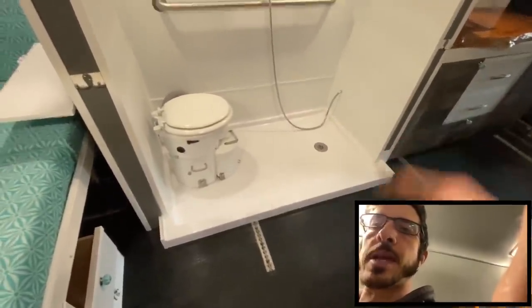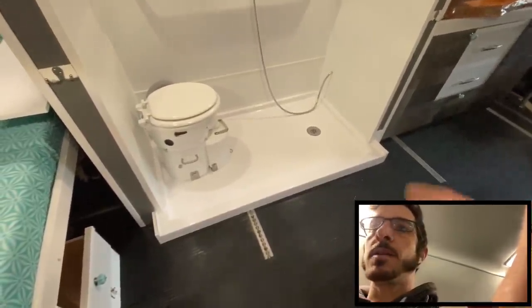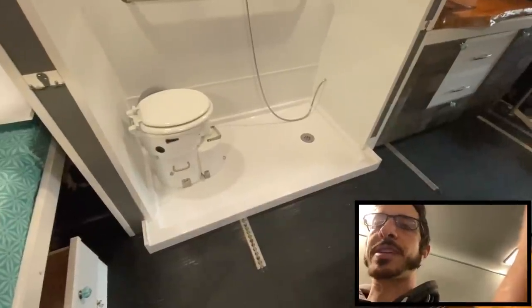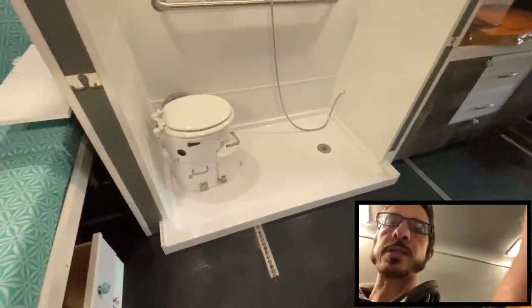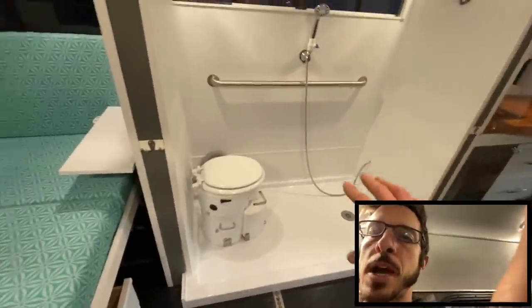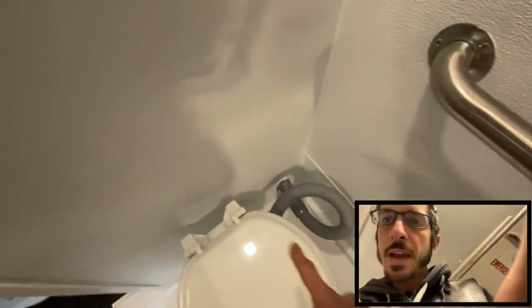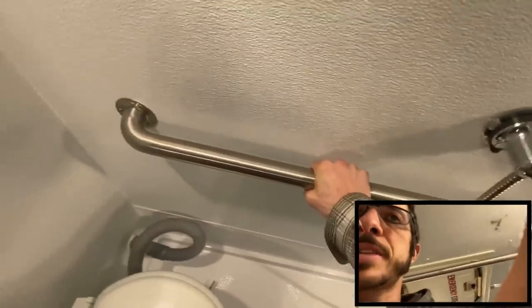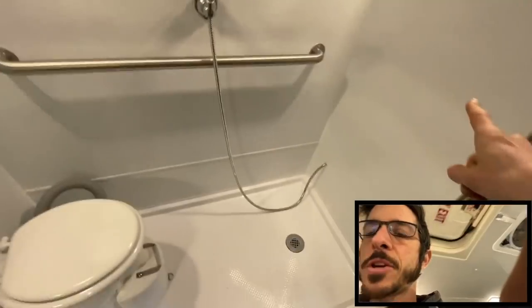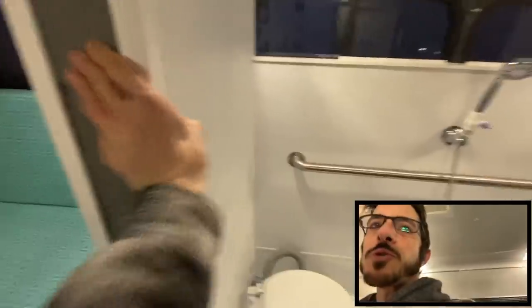The owner has a little difficulty stepping up, so the low-clearance shower pan was important. I did mention that because of how low-clearance it is, you're going to have to be level to take a shower to make sure everything's draining properly. There's also a composting toilet with a hose that vents outside. I put in a grab bar for her - really solid. The whole frame of the shower is three-quarter ply and two-by-four framing, so this whole shower is super rigid and going nowhere. The grab bar is lag-bolted into two-by-four studs.